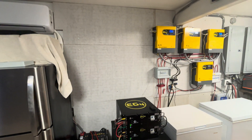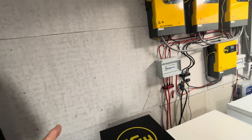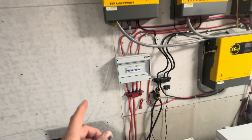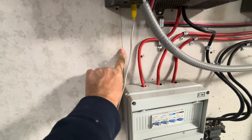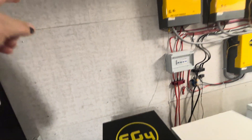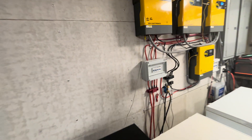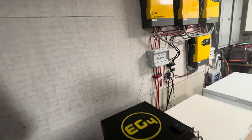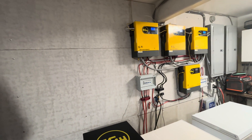We've got the wall set up, all ready to go. We put another piece of three-quarter inch plywood to build up behind this, and when we put the backer board on, it came up pretty flush. We put three pieces on there, and that backer board is fireproof — the kind you use in bathrooms behind tile. It's great to use here for the fireproofing.